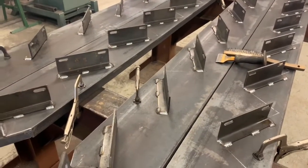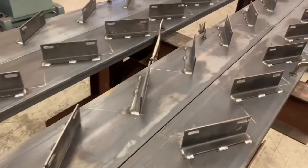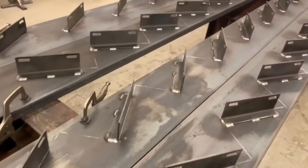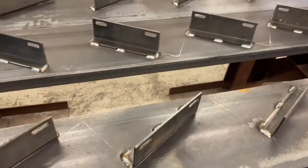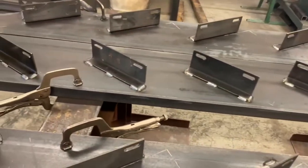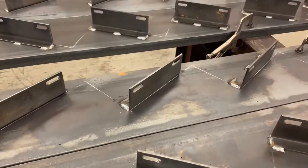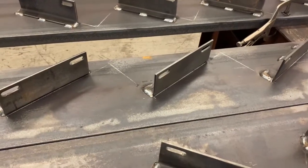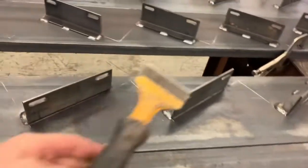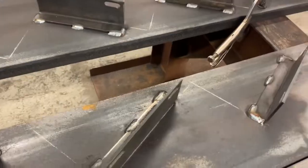The last thing I do is go over and do a quality control check — walk down each one and double-check the welds are all done, nice and smooth. If you have a little hiccup here and there, take a flap wheel on a grinder and just buff it a little to knock it down. We also use anti-spatter — you saw that earlier where we sprayed it. I had some issues since we switched to a new brand; I think I'm switching back soon because it's not great. I'll take a chisel or anything with a flat edge and run along to hit any little spatter balls.